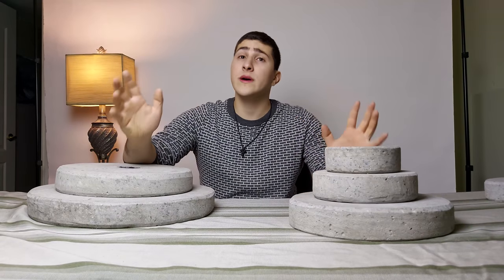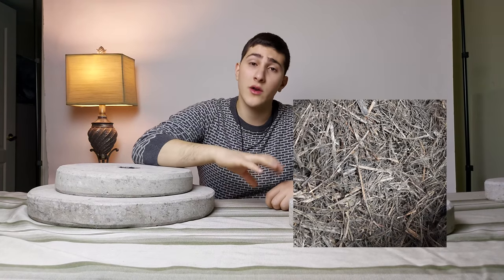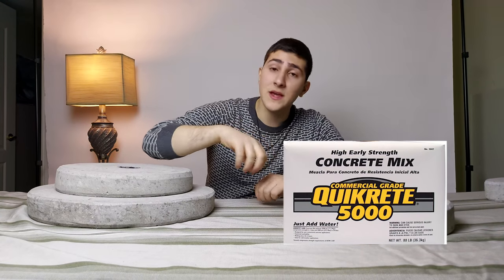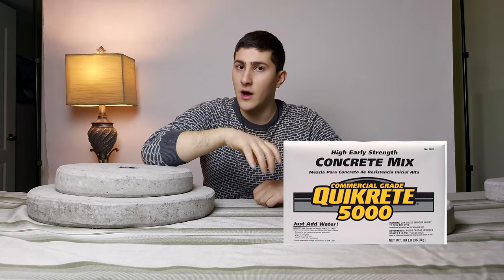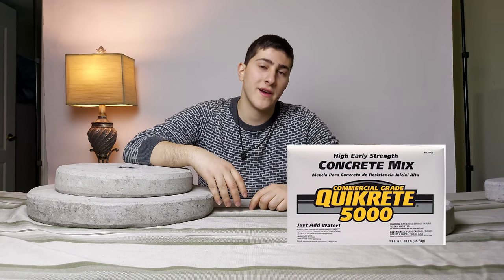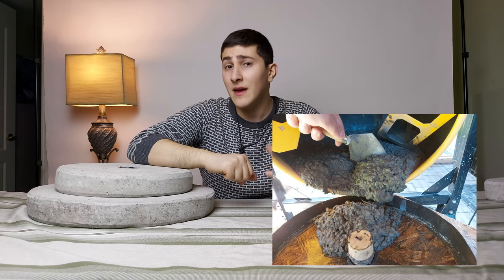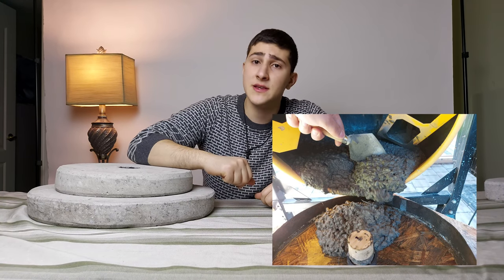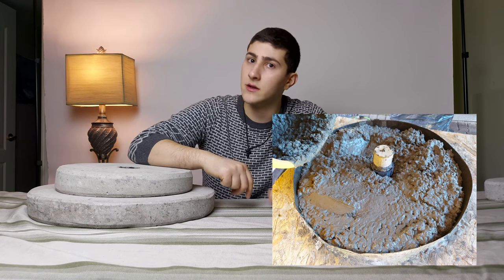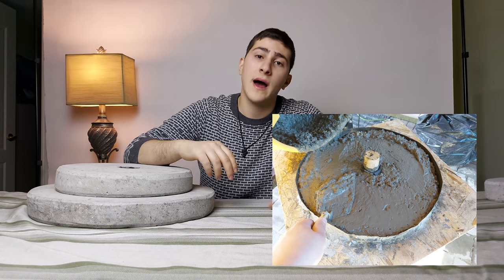Let's start mixing. Always add water first, then place the fibers into the water and mix them in. Slowly add little bits of concrete and make sure to mix it really well every time. For the water to cement ratio, follow the instructions on your concrete bag. Once you have the concrete mixed, pour it into the mold. If the concrete isn't pouring out easily, try to add a little bit more water. If it's too watery, add a little bit more concrete. You want the concrete to easily flow out of the bucket.